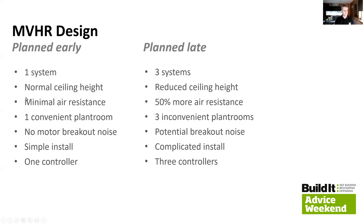The single system has minimal air resistance — about 200 pascals on the whole system, which is very impressive. The most optimistic estimate, had we gone down to three units one on each floor, would have been 50% more air resistance, 50% more work, and more than 50% more electricity — so suboptimal. A single system located in the basement is very convenient: there's loads of space, we can avoid tight bends and use nice sweeping bends, which reduces the system pressure and the workload that the machine has to do.